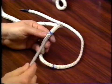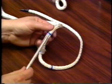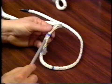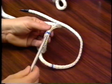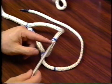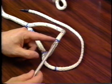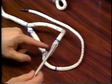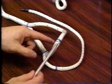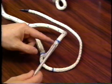Open it up. Make sure you split the strands by their pairs now. Come, I'll say like a ½ inch back. Don't go in right at the mark. Come back a little ways. Because you're going to find we're going to have a crossover point where the two crossovers are going to be just this side of that reference spot.